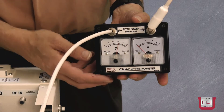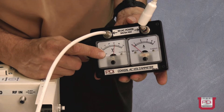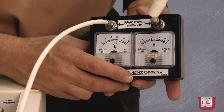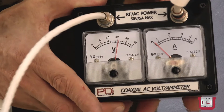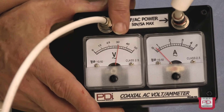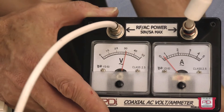The TV in a standby condition does have a quiescent or standby current that is being drawn; however, it is very minimal. With the pure copper coax connected, we're looking at the voltage being supplied to the TV, and we're seeing almost 31 volts — closer to 32 — at a standby current of approximately 0.1 amps. Turning the TV on, the current has risen up to half an amp, but the voltage remains almost the same — dropped maybe a quarter to half a volt, and that's perfectly acceptable with this coax cable.